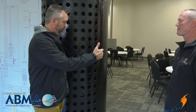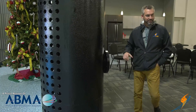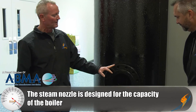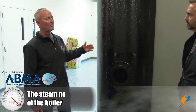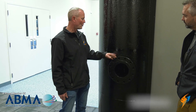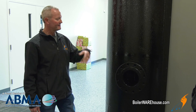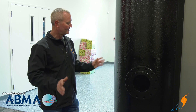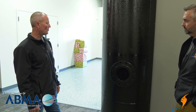There's also the steam nozzle back here — that's where the steam actually comes out. The steam nozzle is typically designed for the capacity of the boiler. On this rental unit, they oversized it a bit so it can operate from 150 up to 325 psi. Normally you'll have a non-return valve mounted right on this so the steam pressure in the system doesn't come back into the boiler — that keeps the two systems separated. That's pretty much the steam nozzle outlet.